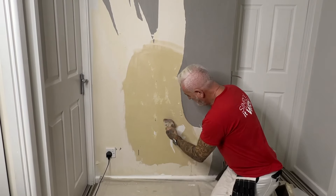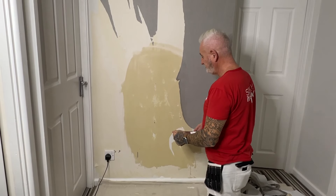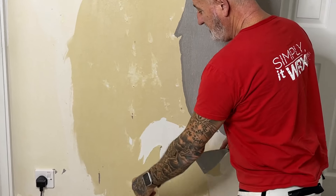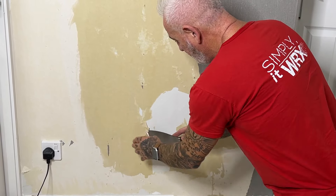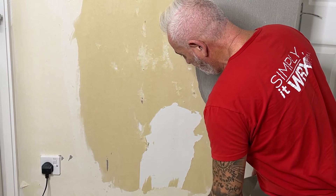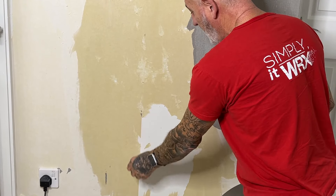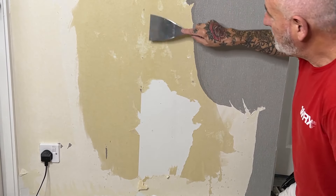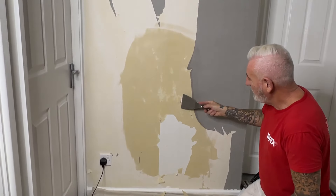This is in real time — that's been soaking maybe two minutes. I'd recommend three or four minutes and you'll find it starts coming off easily. When it comes off, it will come off literally in great big sheets once the paste has been activated — or deactivated, because it loses its adhesion when diluted with water. This backing paper is still a little bit stiff so I'd give it a couple more minutes. With your stripping knife, when you soak it long enough, the knife will just run through it really easily.